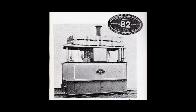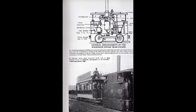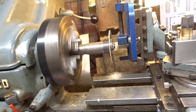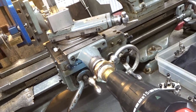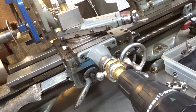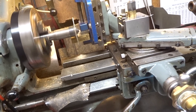The plan is that by the end of the project the steam tram will look something like the two pictures. I'm using a slitting saw mounted in a homemade arbor to cut up a block of brass to make the two cylinders for the oscillating engine.